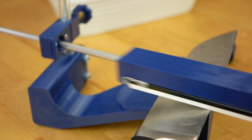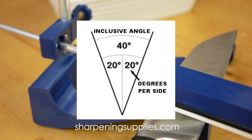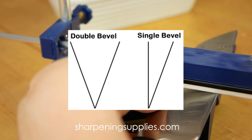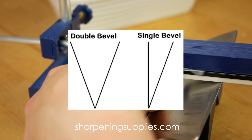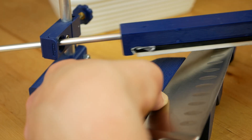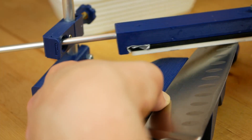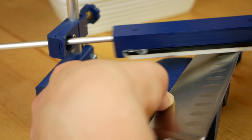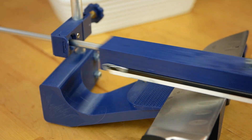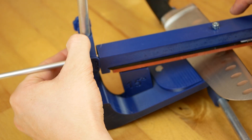Next we need to set the sharpening angle of the blade. The sharpening angle is usually the angle between the symmetry line of the blade and one bevel of the cutting edge. If you have a knife that is only sharpened on one side, like some Japanese ones or scissors, then it's the angle between the unsharpened side and the bevel. This depends on the application and the material of the knife. For standard kitchen knives, 15 degrees is pretty common. For a sashimi knife it can be around 10 degrees; for a chopping knife that has to go through bones, the angle can even be 30 degrees. The smaller the angle, the sharper the blade, but also the less durable it will be. I chose 15 degrees, which is a nice compromise between durability and sharpness.